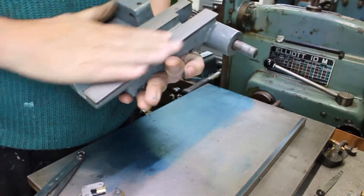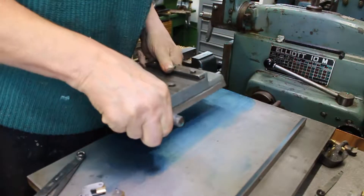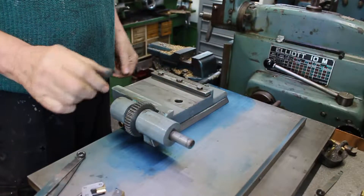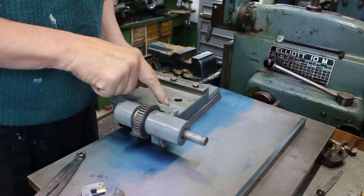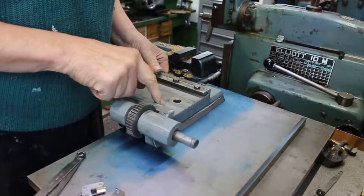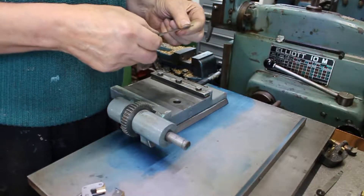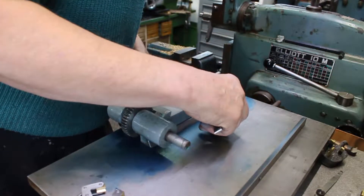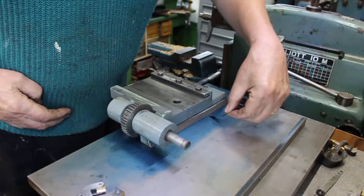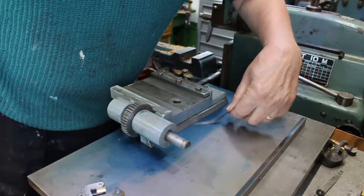So I'll check the x-axis. I'll first place it on the surface plate — I've blued the surface plate — and it seems to pivot just around about there. I would suggest the outer surfaces aren't touching. We'll check with the feeler gauge. So this is one and a half thou, 0.04mm, and it's got a lot of clearance there. So it's definitely got a lot of wear on one side.